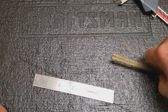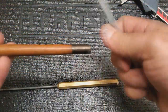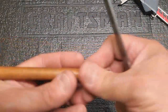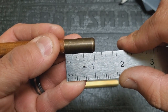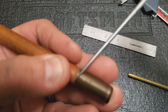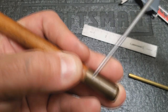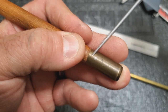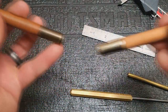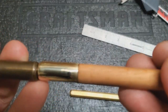Let's take a peek at this garrison rod. We have a seven-sixteenths dowel, probably hickory, and then we have a one-inch long brass ferrule — again with a pin securing everything into place. I figure this pin is about 3/32 inch and seven thirty-seconds up from the base. When I remake it, I use seven-sixteenths brass stock and it's pretty close to the original.